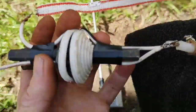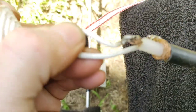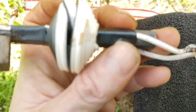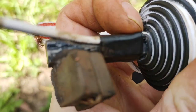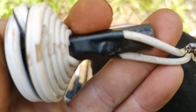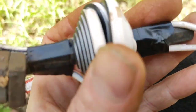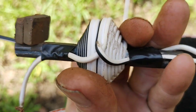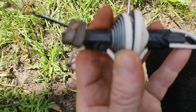Just to get that properly in your head: looking from the transmitter perspective, the active connects here on, say, the white wire — that wire comes from the very beginning of this coil. The black wire splits off in the other direction. So the start of the coil splits into two directions — black this way, white out this way — we wind out six turns, jump to the middle, wind out six turns, and split the final outcome into two directions as well, making sure at each end we have one black and one white.